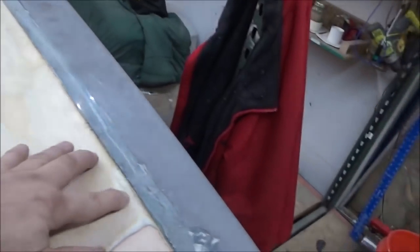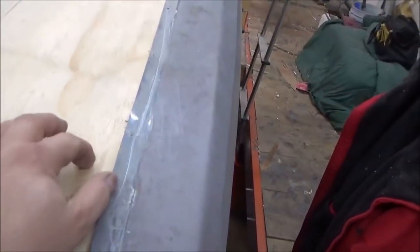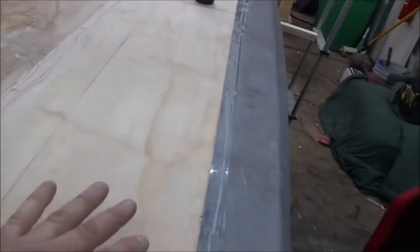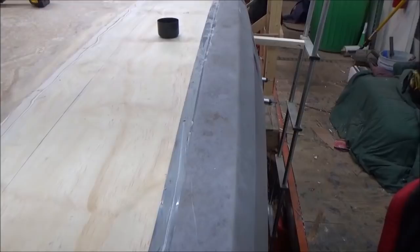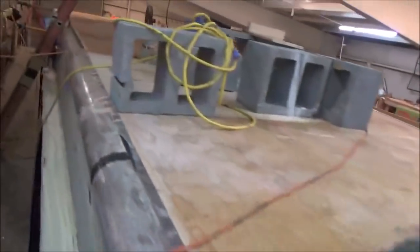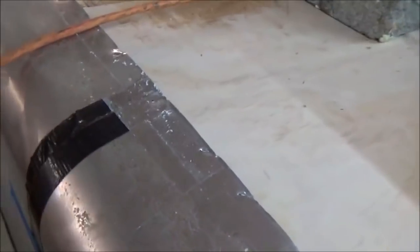That's a good fit right there — that's what we're looking for. We'll be able to get a buffer piece on here and then get our roofing on there. We'll probably have a couple of pieces to make up that transition. I want it to be right because I don't want anything where water can settle in or not look well. You want it done right — so we take a little bit of extra time to make sure it's going to be seated well. All this will come off and we'll put protective strips on.